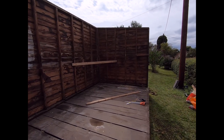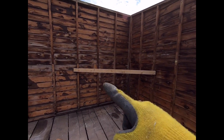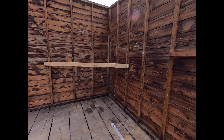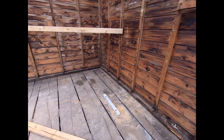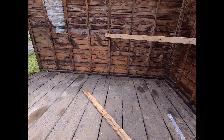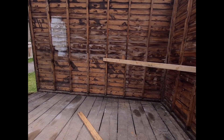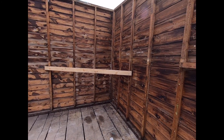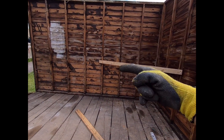We've got the end panel in and braced along here — it's relatively sturdy. A top tip from experience: you don't need to hit all the nails in, because when you need to test and adjust since it's not quite bang on level, you don't want to have to take all the nails or screws out again. Just enough to hold it in place while it's braced around the back of that rear strut.